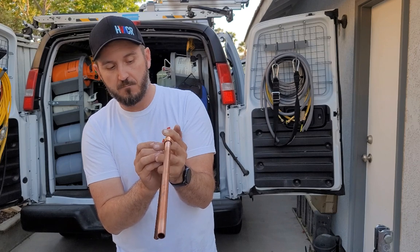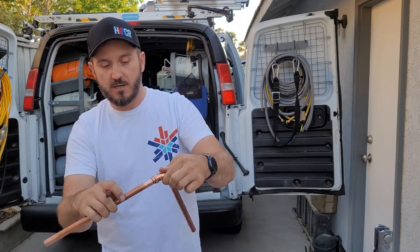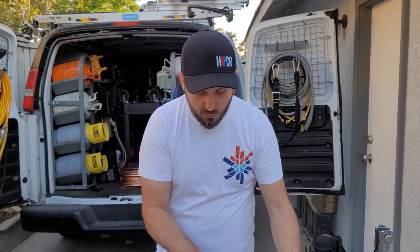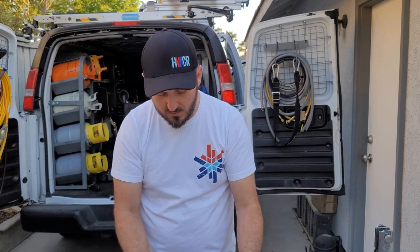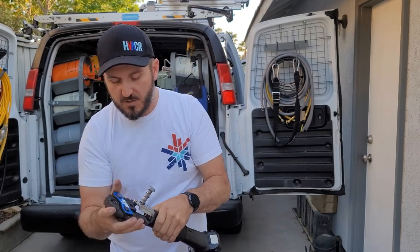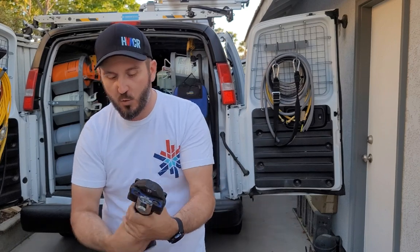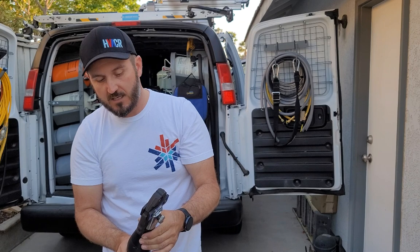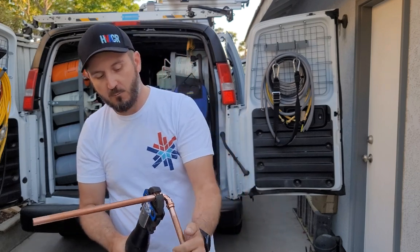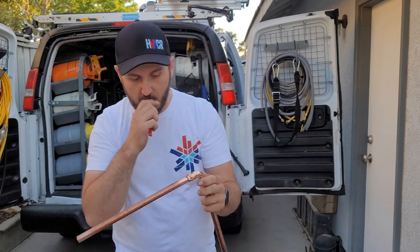It's so important to mark it all the way around because if that fitting pops out for whatever reason and you don't have a mark there, you might not catch that it popped out. As you start to move it, it's coming out — and if you press it there might not be enough material for the press tool to grab and properly seal the copper. This is not taking skill out of the trade — this is making the trade smarter because we have another tool in our arsenal. Give it one solid actuation to make sure the tool is properly calibrated, and press.